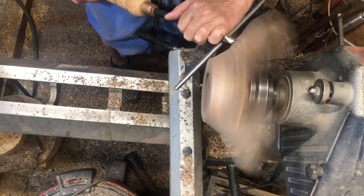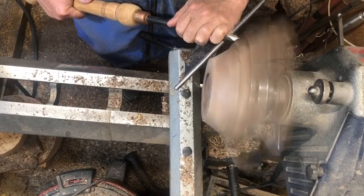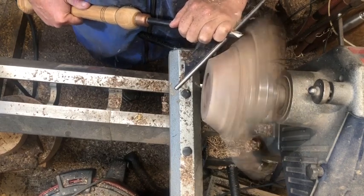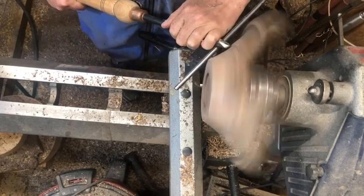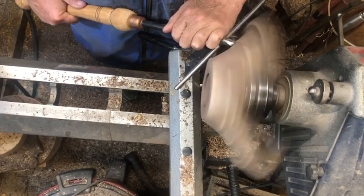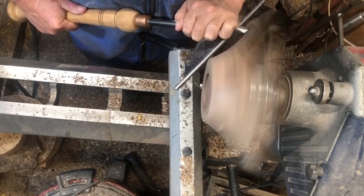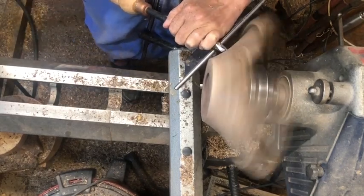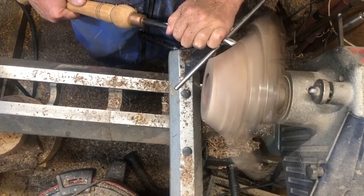Right where I stopped and had a little ledge, it's because I've gone from solid wood to a lot of air. There's not a lot of solid wood all the way around on this piece — really only at the base for about an inch, inch and a quarter. Then it's air, and the further up I go, the more air I've got. So that's a little bit of an issue.